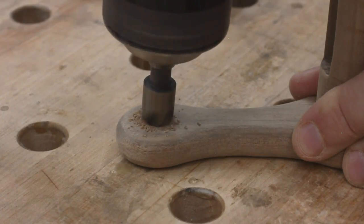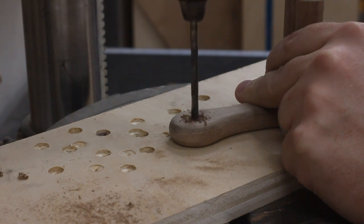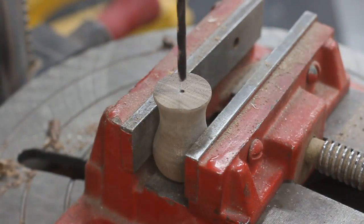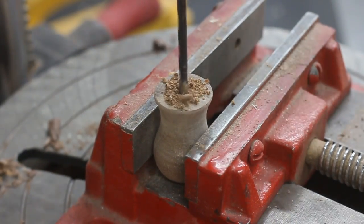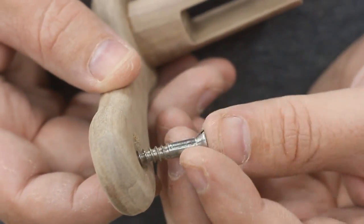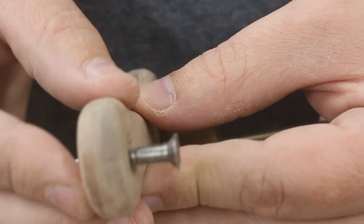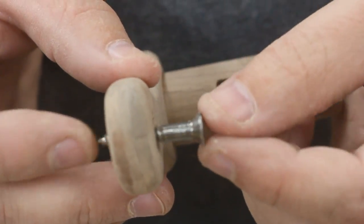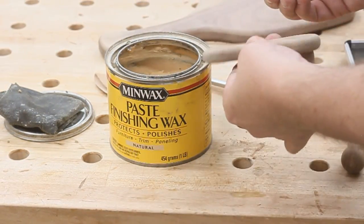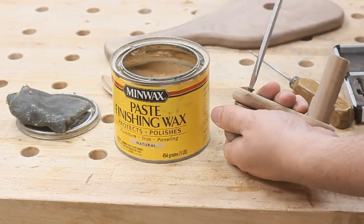I countersunk a location on the end of the handle just big enough where my screw would sit flush, and then I drilled a large hole through the center of it. Then in the knob, I drilled a smaller hole so that the threads of the screw would really bite into that. The idea is that since there aren't any threads on the upper section of the screw, it'll spin freely in the handle but not in the knob. This will let you turn the handle easily while holding firmly onto the knob. I added some paste wax to the threads of the screw and into the hole of the knob, then using a screwdriver, I gently sent this flat-headed beauty to his new home.